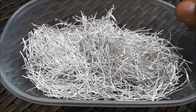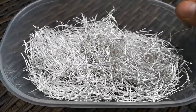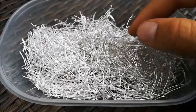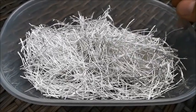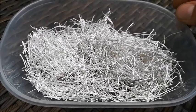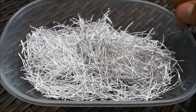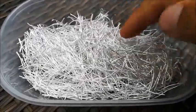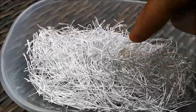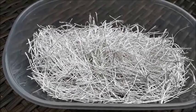We have approximately 100 grams — that's 3.5 ounces in North American measurements. That means for 400 grams we would need to have 25 to 30 grams of silver. We're going to use a really simple silver recovery method called the chloride method: soak the wires in nitric acid, then precipitate with salty water, and then recover the silver chloride to calculate the actual silver composition.